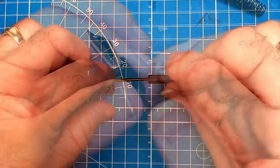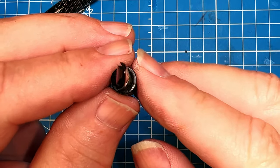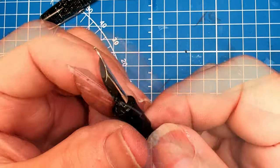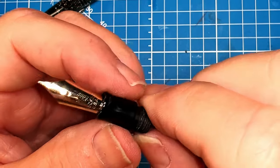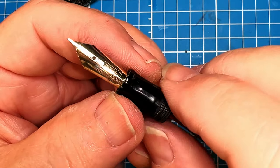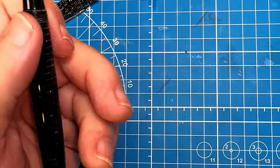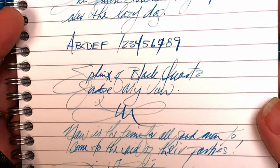I am going to try to put the nib back on. It was quite a job to get it in there because that nib is misshapen. It was not only gouged very severely — I smoothed it out quite a bit, but there is still a little bit of a gouge under there. That feed is round, but the section is misshapen because someone applied heat to it. I got it roughly cylindrical, but the feed still didn't really want to fit down inside that oval hole. It is in there as deep as it will go. I dipped the nib in ink and got it writing very, very nicely — it is very fine and quite flexible.